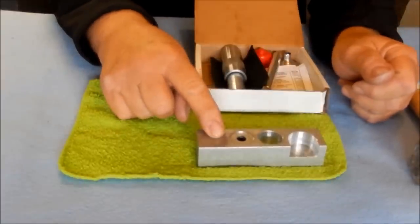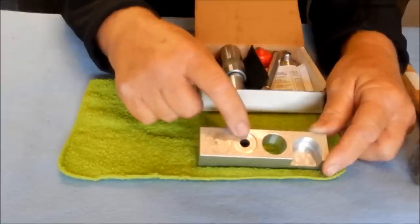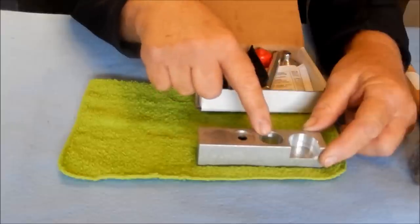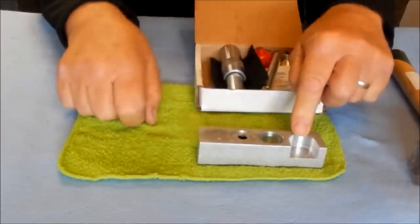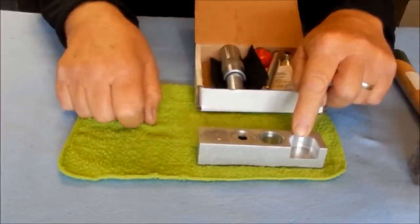The multibase has four workstations. One is the strike pad area. Two is the decapping area — this is where you take your primer out of the shell. Three is where you dislodge the shell from the size die if you're using the sizing method. And everybody ends up at station four, where you insert a new primer into your case.